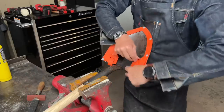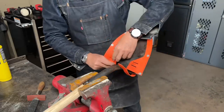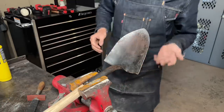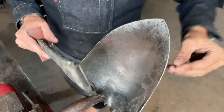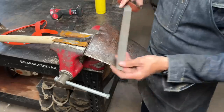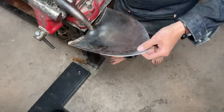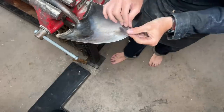With the handle installed, now we're ready to file or reprofile the spade. All fire tools will have sheaths. The reason being is that we keep our tools very sharp, sharpening them multiple times a day, and it's highly likely you might need to get it into an aircraft for evacuation — heli-tack — and you don't want anything sharp or unsheathed in an aircraft. This fire tool was used pretty heavy last year and needs to be reprofiled — you can see it's lacking the point. When you're filing these, you want a chisel file — an angle on one side and flat on the other. You always start by flattening the back. Do this with a 12-inch mill bastard file, holding it flat and knocking off to get a nice filed edge. With the back flattened, we'll reestablish the point. I'll remove the soft jaws from the vise so it holds very firm, because I need to put some pressure on this.